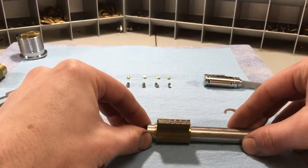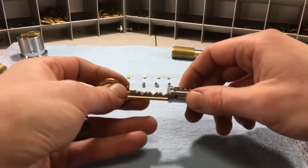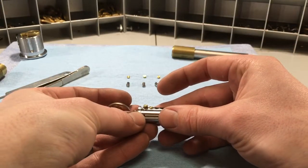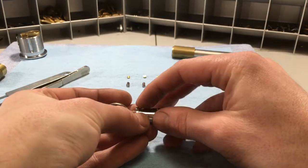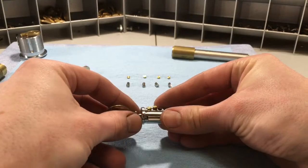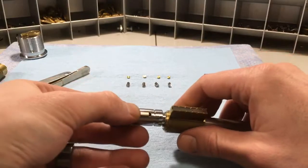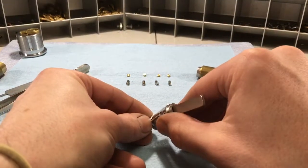That wasn't the case with the older style 20 series, and there are still plenty out there. What happens is when you put the master key in here — I've got the pins in the first two chambers — you can see we're at the shear line in the second chamber but not in the first chamber. The bottom pin is at the shear line and this was resting above it. On normal pin tumbler cylinders this isn't a problem because you can just put the pins all in there and once done, push against the follower and reassemble.